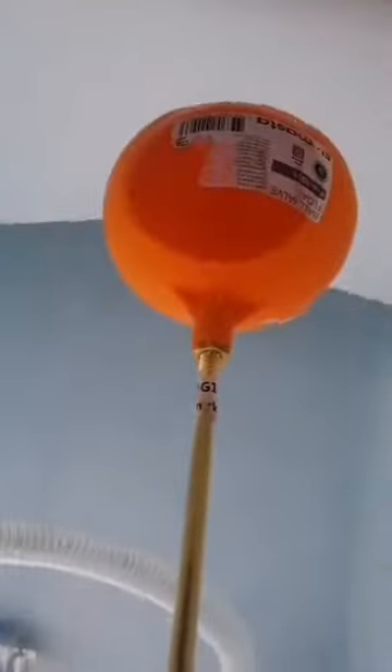The ball's been fitted, screwed on as far as it will go, and they're not over-tightened so we're not going to get any issues with that coming off. It's as simple as straight into the tank — straight in there — and then that nut straight on there. The nut is on; I'm just going to get a spanner and nip that up. Make sure the ball valve is completely straight as it's coming out, just straighten it up slightly, and nip the nut up.